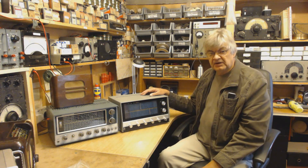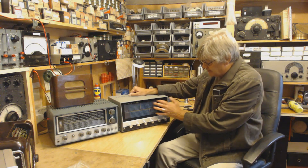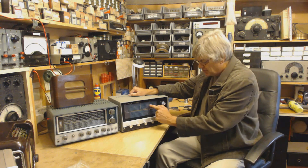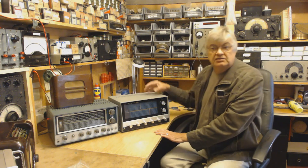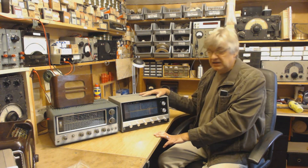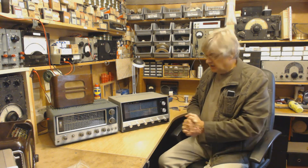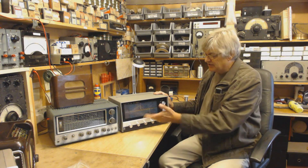Another thing I did — I turned the volume down on the KT340 and was tuning around on the HA600A, getting so-called birdies. You tune around and there's a massive carrier somewhere on the band, or several spots. You take the aerial out and you can still hear it, so you know it's not a radio transmission. It's something produced within the radio — normally oscillator harmonics and the mixer putting out other frequencies — so you end up with phantom carriers everywhere.